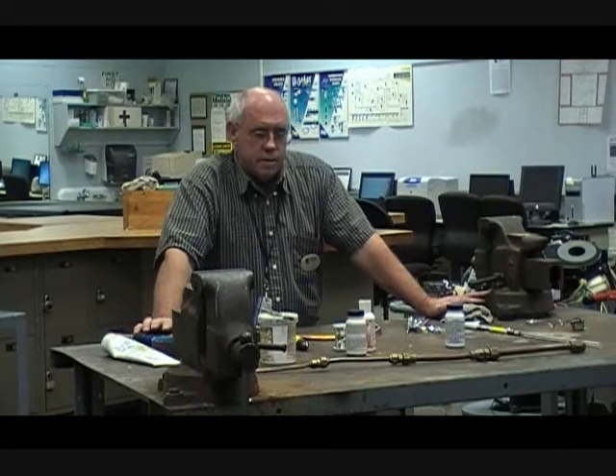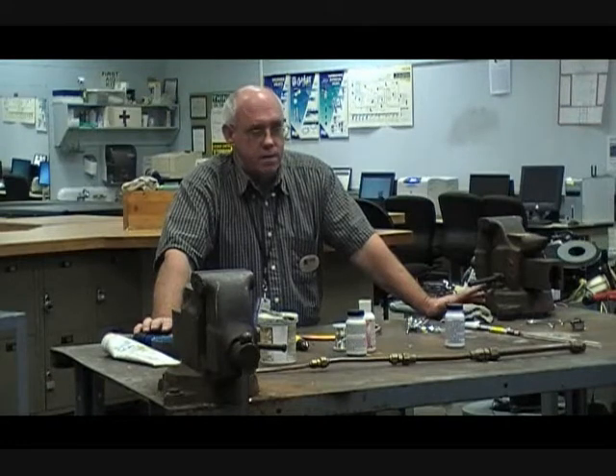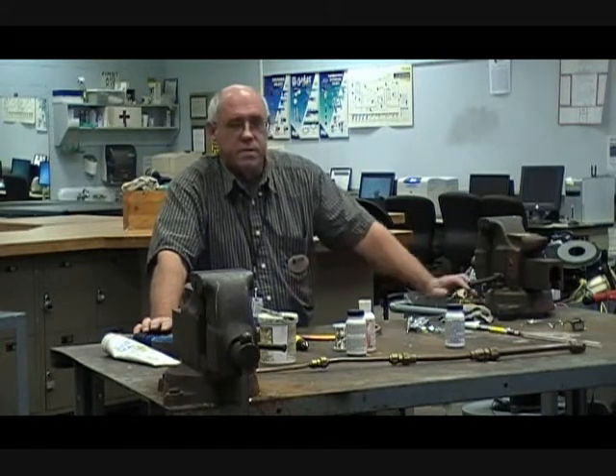Here's another one: you can't leave that job until the last hot work is done and then two more hours. Think about that — I get through soldering, I'm done, but I can't leave that spot for another two hours. They're serious about it. You know why? They lost some million-dollar buildings, so they got real serious.